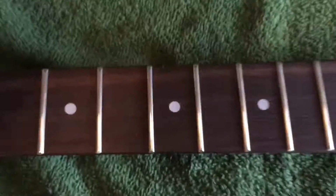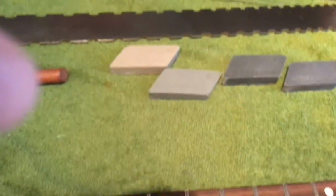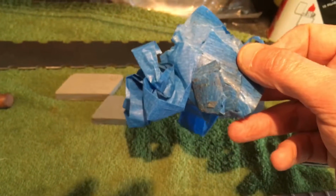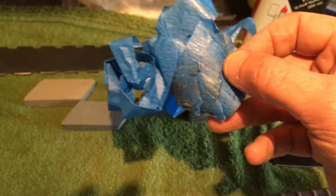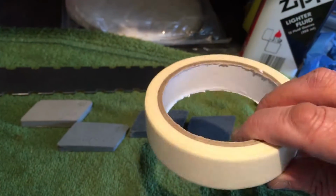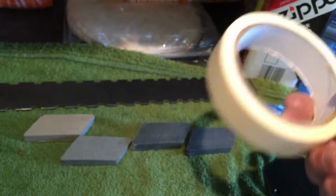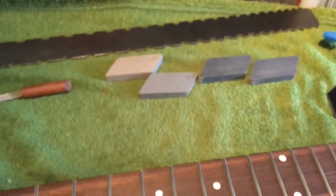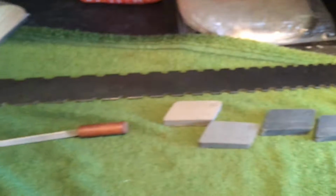Then you can crack on, tape up. Next piece of advice is use good tape. This blue stuff is good, it's thick, and when you rub the file over it, it doesn't tear it and all that sort of thing. If you use the cheapo pound shop one, which usually looks like that, it'll just tear and damage your thing. Depends what sort of finish you're going for, obviously, but anyway, that's that.